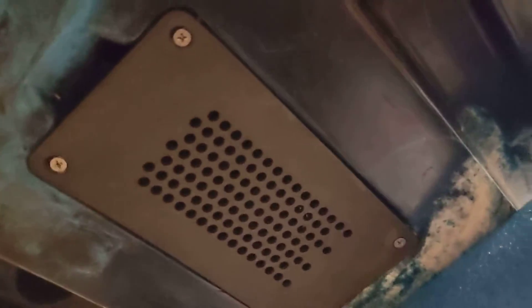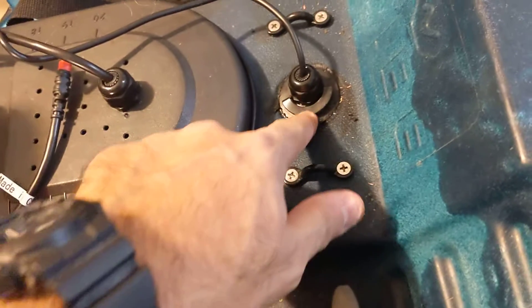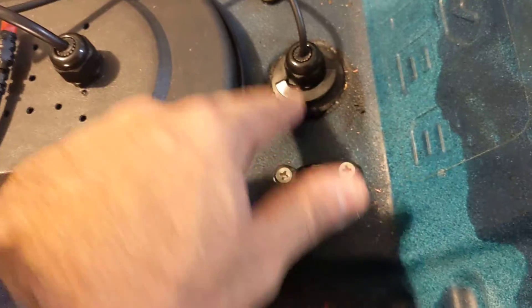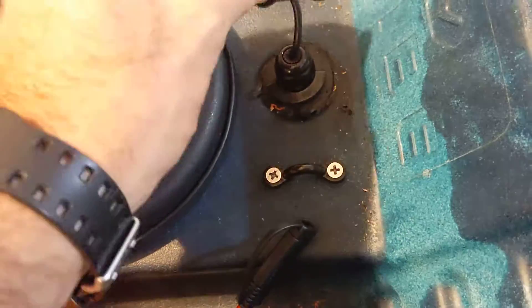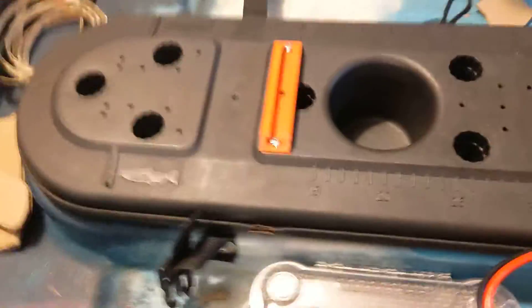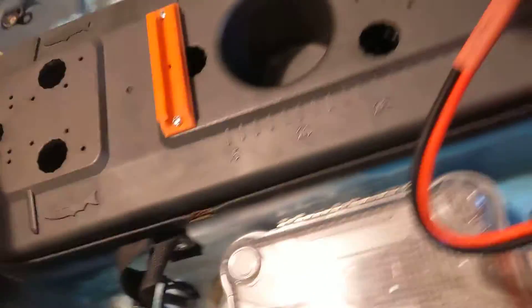The transducer is mounted in a hole up here — cable comes through here, and I used one of these old plug fittings with some silicone around it to seal it so the cord can still move but it's tight. You can see the cable going through the boat. Everything is compartmentalized — I can pop a cable out if I need to and it's not gonna let water pass through.